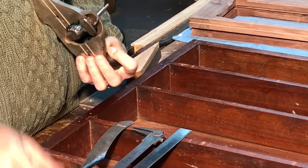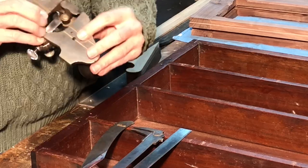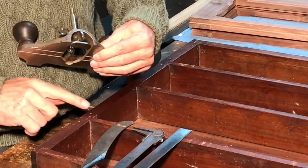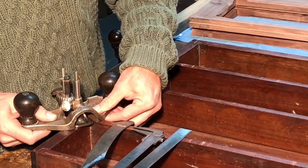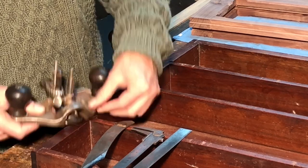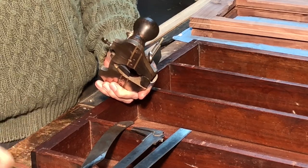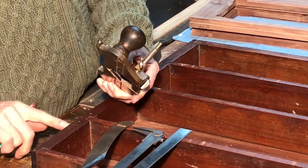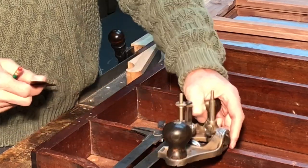And the reason is that I'm going to use it as a marking gauge, by putting just the corner of the blade, just that corner, against the edge. I'm using it as a marking gauge and sliding it on that angle all the way across. And that is giving me my first little cut along here to ensure that I don't have tear out in this direction. So once I get that sliced and that sliced and that sliced, and then dug in a little bit,